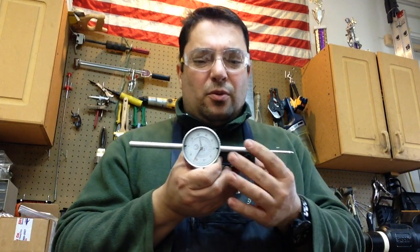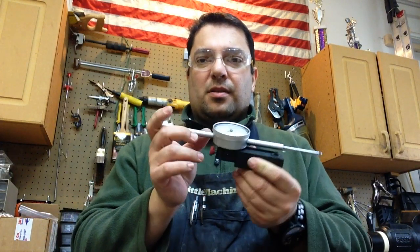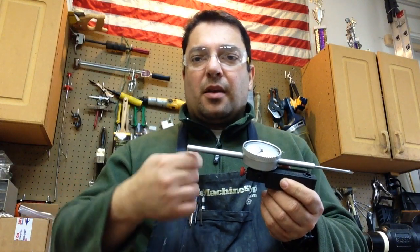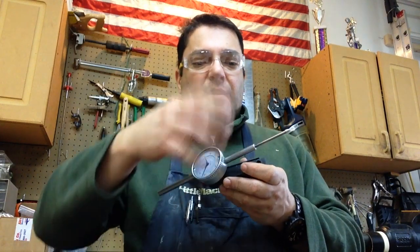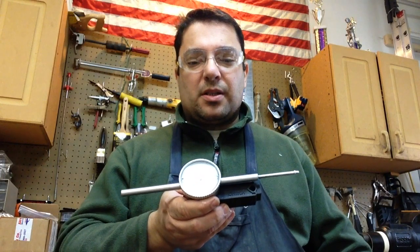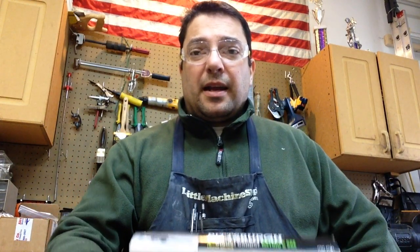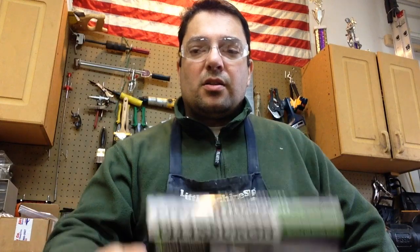But this unit has a few issues. One thing is the size of this back piece — I keep hitting it when I crank the tailstock, and that creates a problem because as I hit it, it goes off and all my measurements get messed up. So a little while back I purchased a four-inch digital caliper from Harbor Freight. I paid about $9.99 on sale and I figured I'd use this to attach it to the tailstock somehow and make a digital readout out of it.